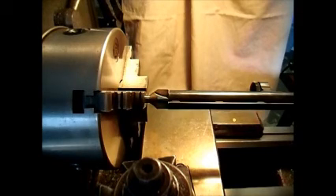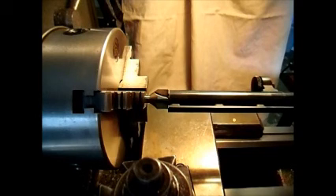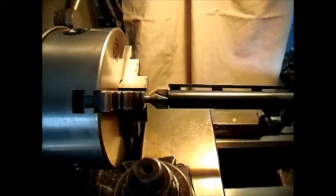In the stills I showed you, you're going to deburr the inside first so that the bushings will slip in nice and easy. You can use a hand drill to do this — if you do that, you want to use one with variable speed so you can keep the speeds low. You're going to want to use a good cutting fluid. Tap Magic will work just fine. Here in the shop I use Spectrum cutting oil, which is made by Conoco. There are all kinds of good quality cutting oils that machine shops use, and if you have a local machine shop, they might help you out by finding something local.